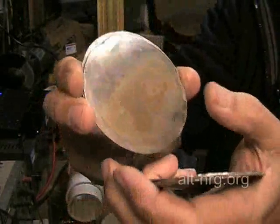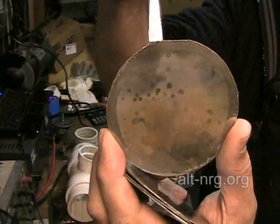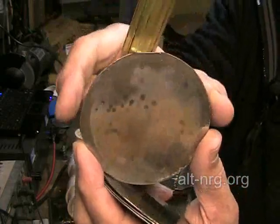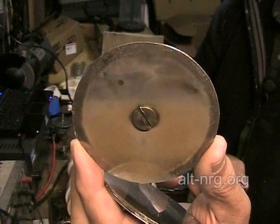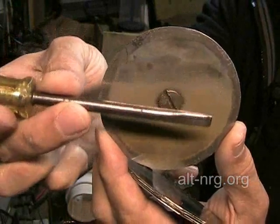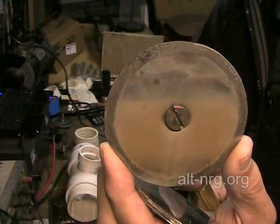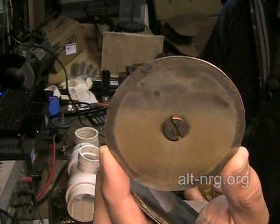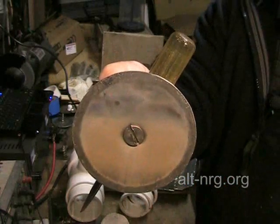Lastly, this is the last neutral plate next to the negative electrode — we are now almost half exposed. And finally the negative electrode — look at that. The only part of the plate that was actually doing anything was this part down here that has brown residue on it; from here up, nothing. All it was doing was trying to push gas out, but the pressure buildup behind that small orifice was preventing it from going out.